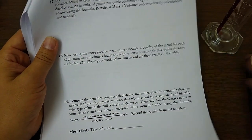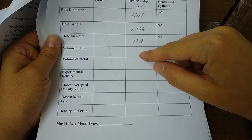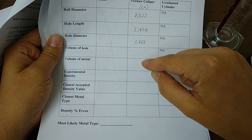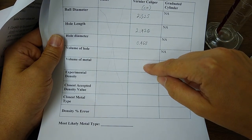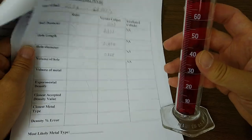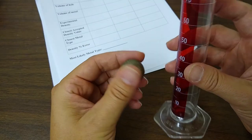If we say it's a perfect sphere, we can calculate its volume from the diameter alone. Then, since it's not a perfect sphere — it has a hole drilled through it — we take the volume of the perfect sphere and subtract the volume of the hole to get the actual volume of metal. The other method I'll use now is measuring the volume of the metal using the water immersion technique with the graduated cylinder. This is a handy method for oddly shaped objects.